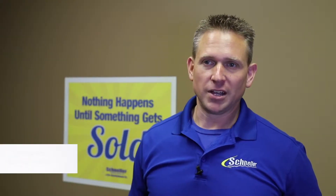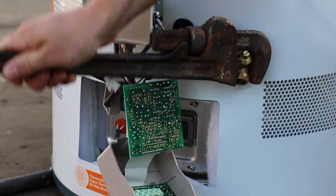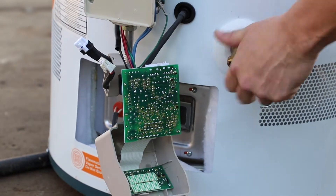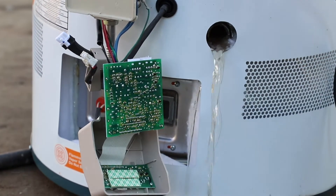When you look at the top of the water heater — say you're downstairs putting some stuff away and you notice the top of the water heater looks abnormal. If it looks like rust, or what I call snowballs — little white powdery stuff all over the place — that's the hard water eating through the piping in the top of the water heater.